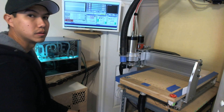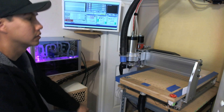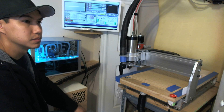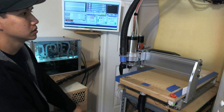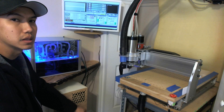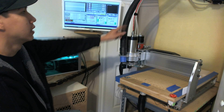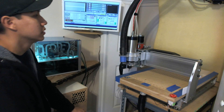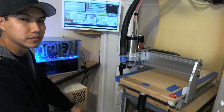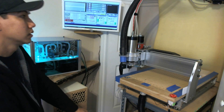The problem I had with the VFD cable was that the first cable I put in was unshielded, and because the Chinese VFD creates a lot of noise, it used to make Mach3 go into E-stop. Now I put in a shielded cable and grounded it to the base and to the VFD to get Mach3 out of emergency mode when the charge pump on the Gecko G540 was on.